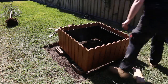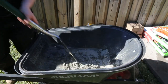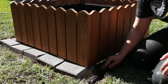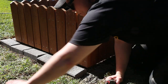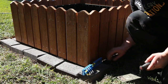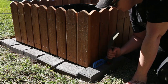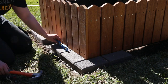The pavers I am using are 200mm by 150mm by 50mm deep. You could just use paving sand and sit the pavers on top, but I wanted to concrete them in to stop weeds growing and to stop them from moving. You want the pavers to be sunken into the ground about half their thickness. I mixed up the concrete and got to work — I have never done anything like this before so this was a big learning curve. I took my time to level the first brick because I knew I'd be leveling everything off that first brick. I started at the front as it would be the most visible side. I would lay down concrete, put the brick into place, and using a level and a hammer I would knock the brick into place and level with the previous brick, making my way around the planter.